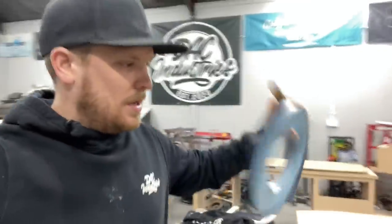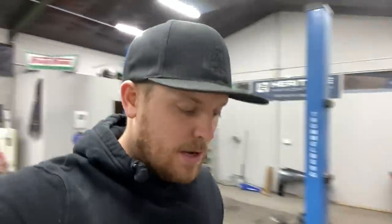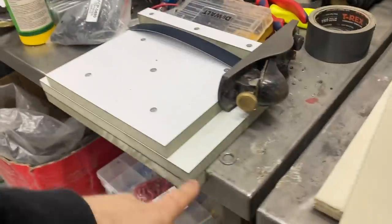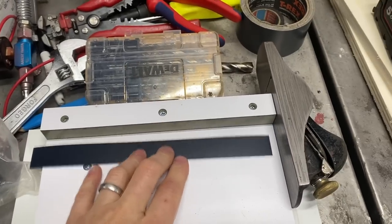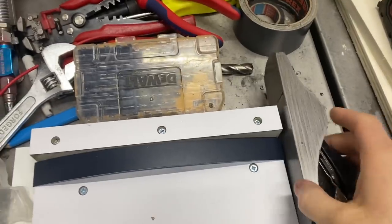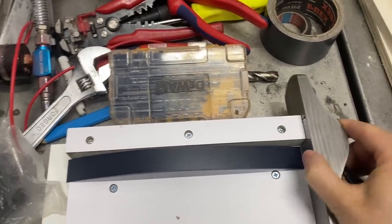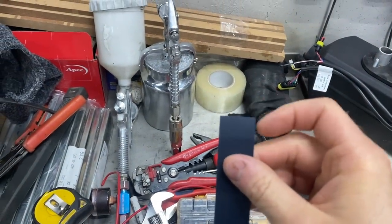We've then got the edging on the roll, which is here, that we've brought back with us, some tin snips, and we'll cut ourselves a piece off so that we've got roughly the right piece. And then I've made something called a bench hook, which is this, basically a bit of wood there to stop it moving forward, a platform, a bit that's recessed back, and another stop. You put your piece of edging up to that and over to the edge, sort of hanging over a bit, and you then run your plane along like that, and that then squares that cut up and makes it a nice clean edge. So that's now 90 degrees and 90 degrees, gives you a nice edge.